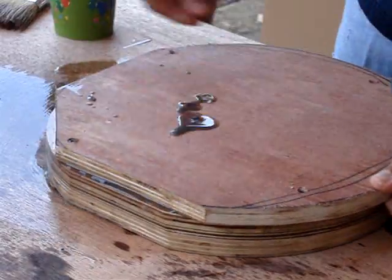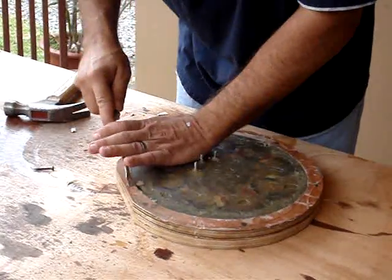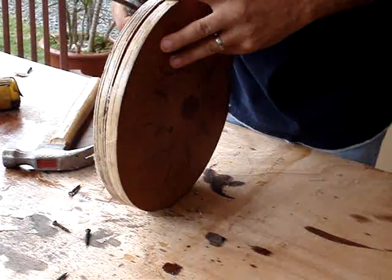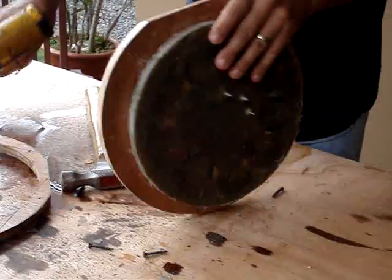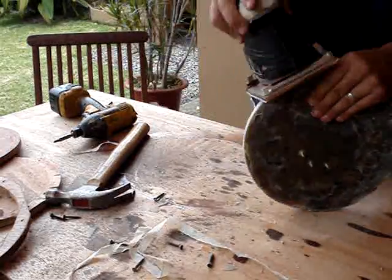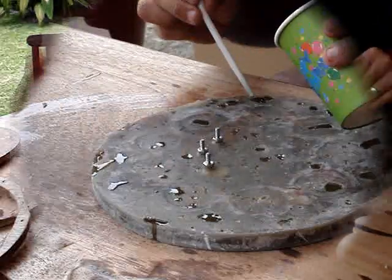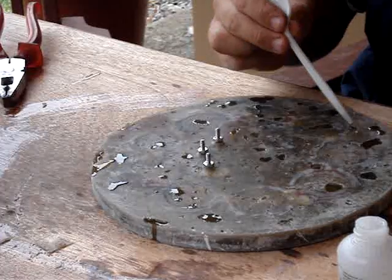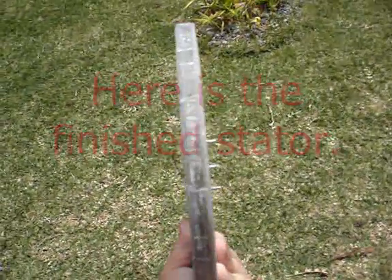After about two hours I went ahead and removed the mold from around the stator, got it all cleaned up, took the screws out, and everything came apart fairly easily. I took the screws off the back holding the center wood piece and it popped right off. Then I cleaned it up with a little sanding, and for any small imperfections I mixed up a little more resin and filled them in. After it hardens I'll sand it down, and next I'll work on the rotors — getting the magnets in. That'll probably be the next video post, so thanks for watching.